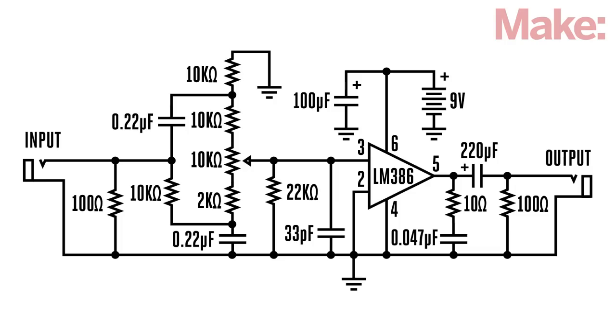Let's take a quick look at one channel of the schematic. The audio signal enters the circuit and splits into two branches: a high and low frequency. We can adjust these frequencies with the addition of a potentiometer before they're combined back together. The signal then enters the LM386 amplifier chip. This chip is powered by a 9-volt battery and provides an extra sound boost as it exits the circuit.